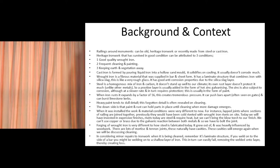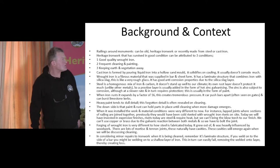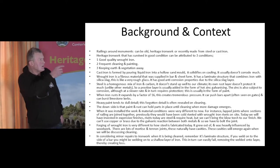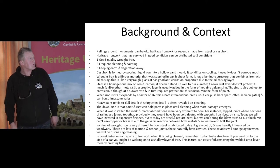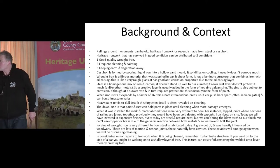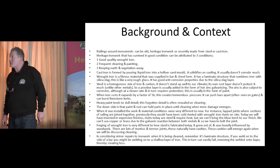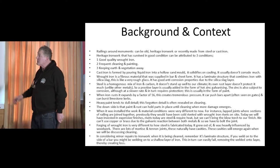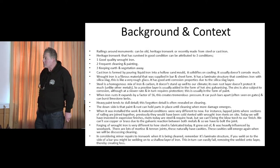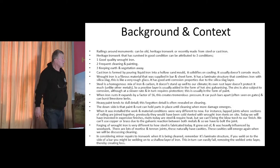Steel is more of a homogenous mix. It doesn't do well in our climate — it needs something else to protect it. We put a layer of zinc on it by way of hot dip galvanizing, but that in itself will corrode, so that will need paint, and that's where new people come in — me as well.